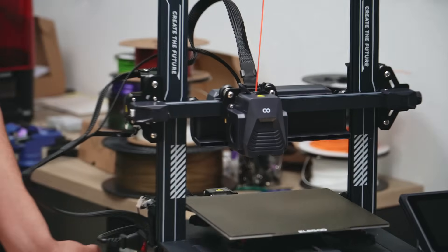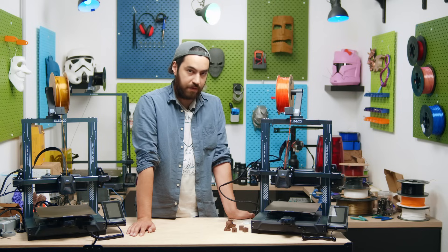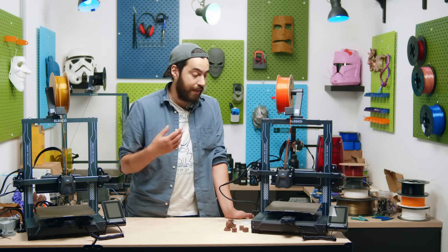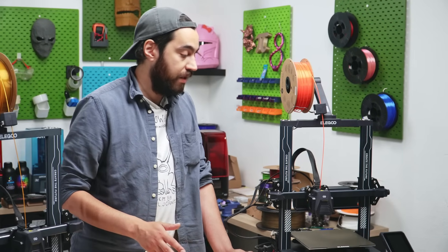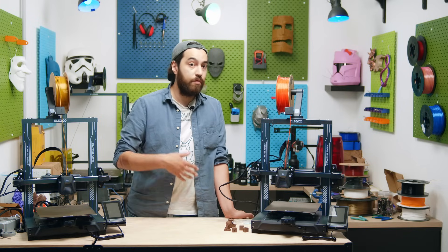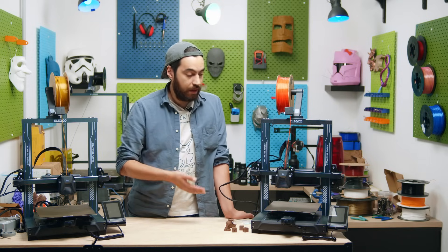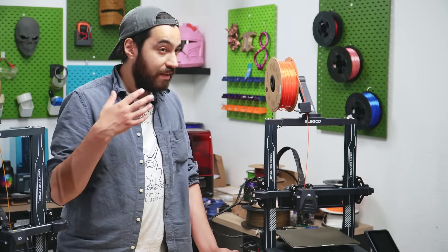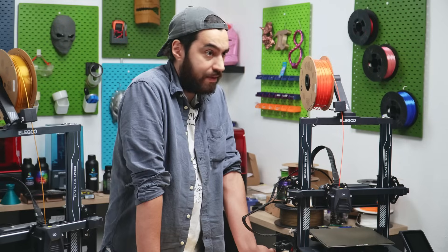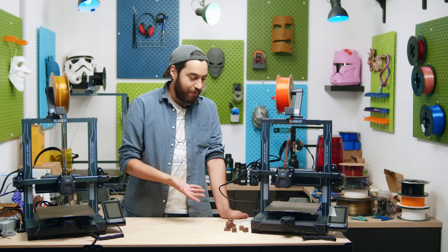What's this guy at the back? It's a big old tank thing. This is actually four extra part cooling fans that are constantly blowing a little cyclone onto your printed part. Because it's a high-speed printer, we need good cooling. I think they got the idea from other high-speed printers like the Bambu Lab X1C or the Creality K1 — they both have big supplementary fans delivering air onto the printed part. It's interesting to see this on a bed slinger that doesn't have an enclosure. Because this prints at 500 millimeters per second — it's crazy fast — and for a bed slinger especially, you really need good cooling. And yeah, this delivers.